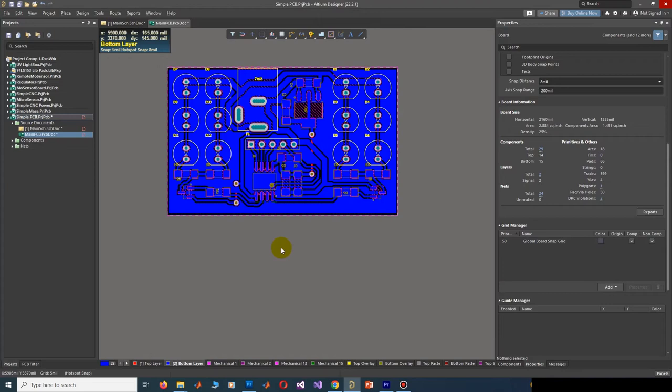The third secret to make an admirable PCB is to set proper clearance. The minimum distance between copper-covered areas of a PCB is called clearance, and in Altium Designer it is super easy to set or change clearance in the PCB file. The default value of clearance in Altium Designer is 10 mils, which is very hard to deal with in handmade PCBs. So we have to change the clearance value to at least 30 mils to optimize the final PCB.